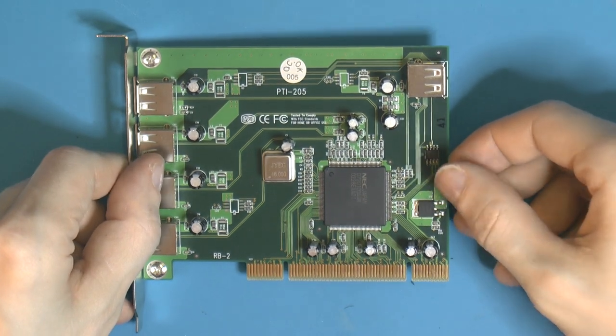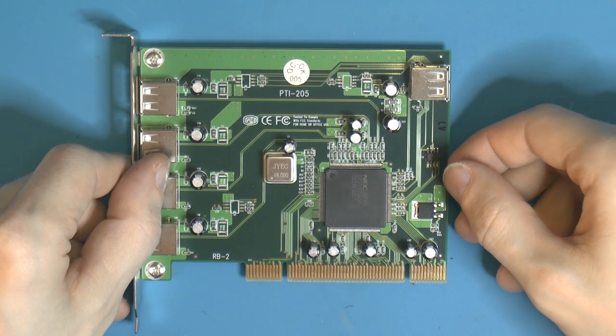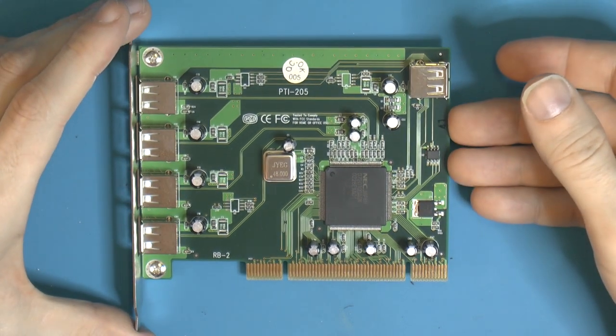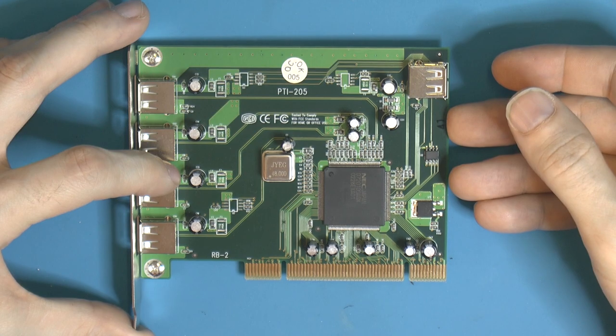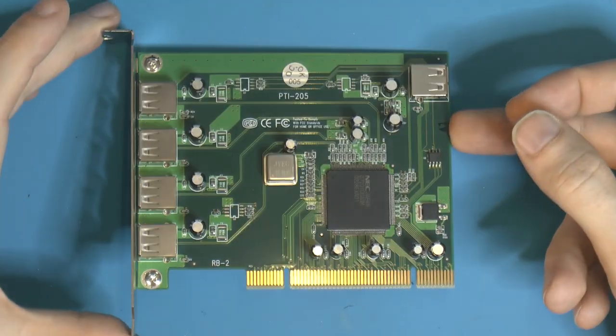There is a header on the motherboard. I found one header. I haven't checked the manual if there's any more, but I think my new case has a front panel with USB behind the hatch. I'm gonna open that and see, because I got a NOS case. So I'm thinking I don't have enough headers to break out another two ports from the motherboard with one of those brackets. So this would solve the lack of USB ports.